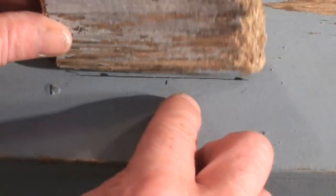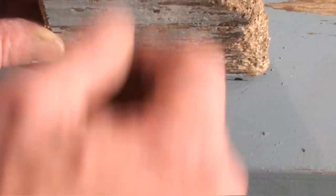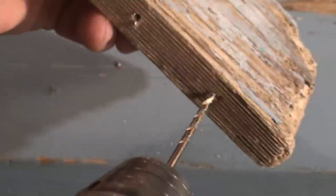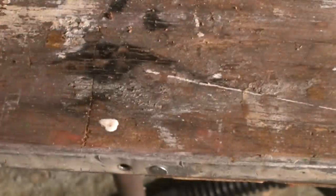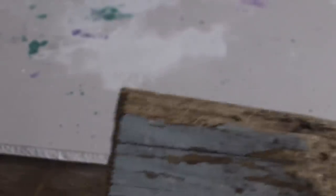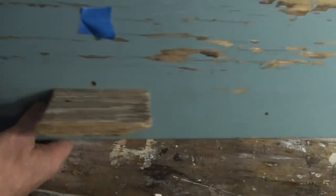I've started the two screws from the back — that's our two-inch drywall screws — just poking through the top. Now I'm going to take the shelf I want to put in that position, pick the nice worn shelf, and position it so the worn edges are at the bottom. I'll line it up on a pencil mark so it's nice and straight and even. I put two little holes in the shelf and start the screws just a little bit, then put everything back in position and cinch them up tight. You can see a nice tight joint, and there we have our nice floating candle shelf.